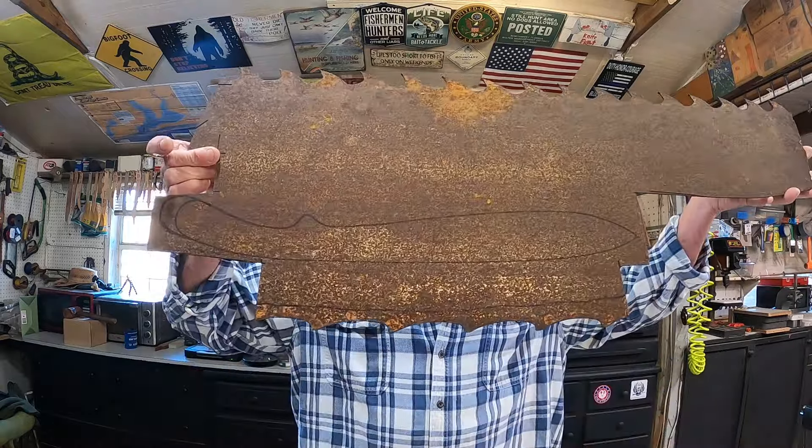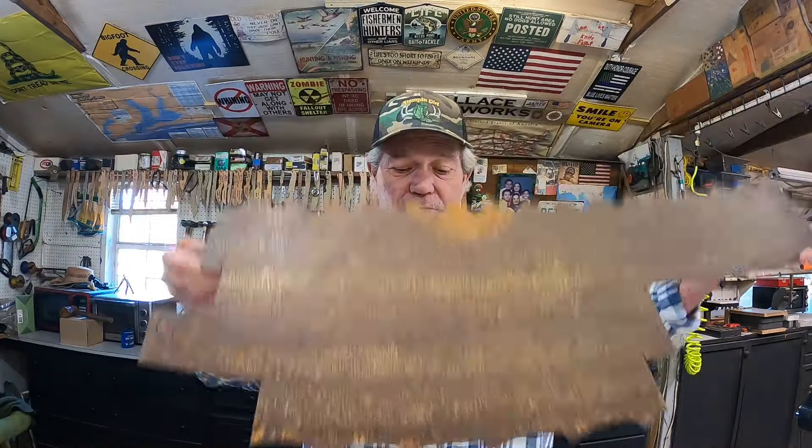This is the material I'm going to use right here — that is a very old mill saw blade. I've already got it traced out. I'm going to rough it out, clean it up, put it in the forge and get it straight and annealed. It'll have a little curve to it, which anything made out of this material does — you have to straighten it out. And that's what I'm going to do right now, and we'll continue on from there.